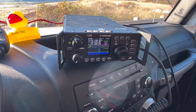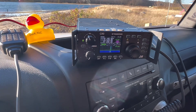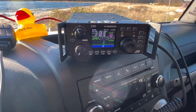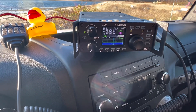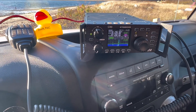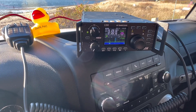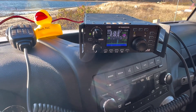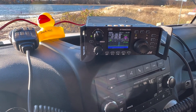Inside, I'm using the Xiegu G90. I know what you're thinking — Walt, you've got the QT80, all that power. But I really want the advantage of the SDR waterfall today, and I like the ATU. SWR is hovering around 1.7, so either I'd trim it or be lazy. I kind of want to try it on 12 meters and use the ATU to tune there as well. So, Xiegu G90, half-wave vertical off-center fed dipole for the 10 meter band — let's see what we can do.